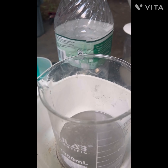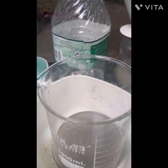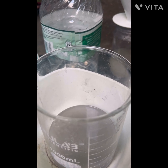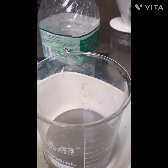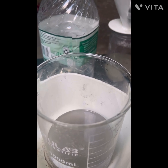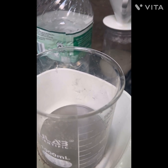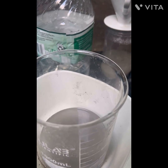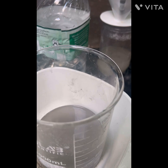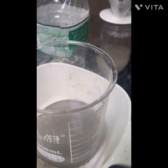Silver recovery with hydrochloric acid and aluminum. And man, I gotta say, I'm pretty impressed with it. It went really well. The problem is cleaning that aluminum up with the rinses to get all that hydrochloric acid out. So we'll see, man. I'm going to run this through the cell anyway. And we'll continue on.